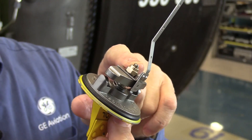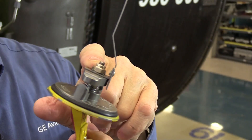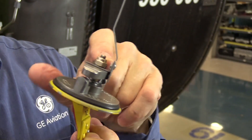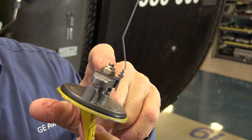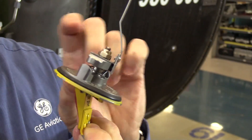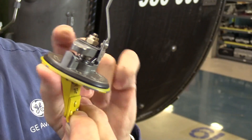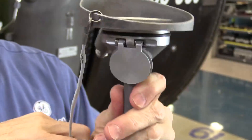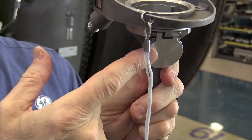One thing never to do: never alter the tension on this cap. This nut should be fixed to this assembly. If you find it loose, you need to return it to the vendor to get it correctly tensioned. This system maintains proper tension to maintain proper sealing on this lid.